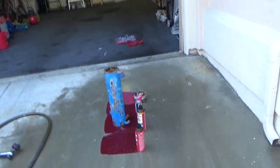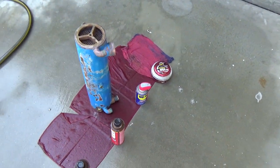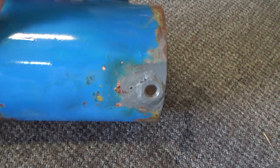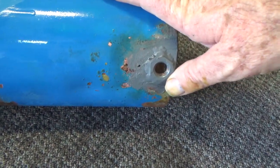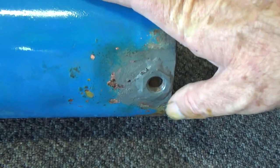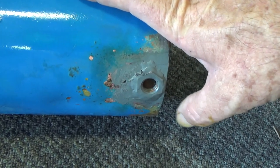So they both look really good, and even the radiator shop guy said, hey, these exchangers look really good. He only saw the one, but he said it looked really, really good. So this is the repair that he did for me. The old one that looked kind of like this had snapped off. So he ground it down and put a quarter inch pipe female fitting there for me and brazed it in. So that's going to be fine.